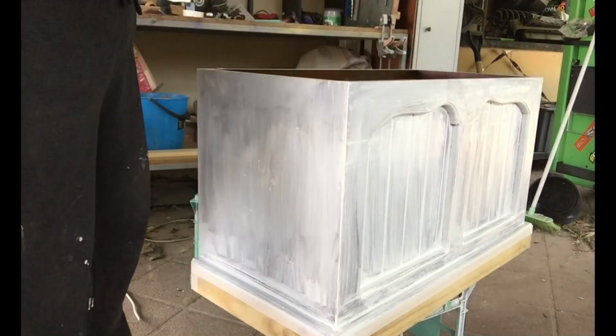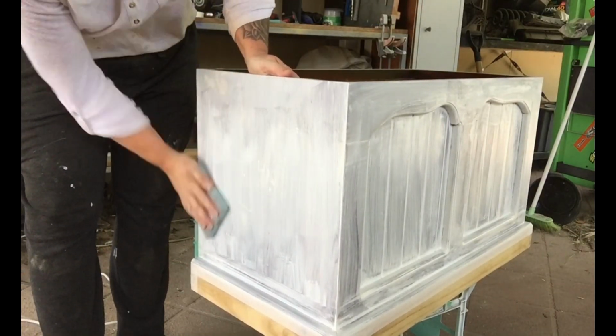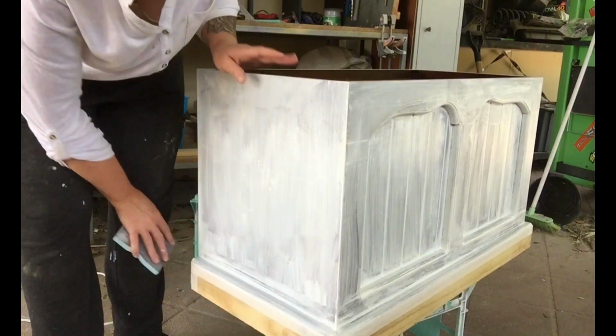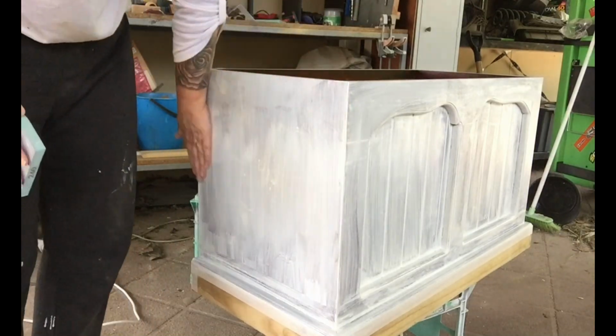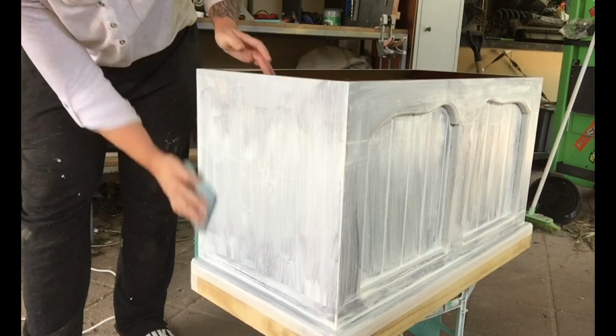When you're doing it, I use the 240 scrubber sheet thingy, and you keep on going harder thoroughly until the stand's off and it's pristine. Just to translate what my daughter said, in between your coats of paint, use a 240 grit sandpaper or above to make sure that your paint's nice and smooth and that there's no little pieces left over.